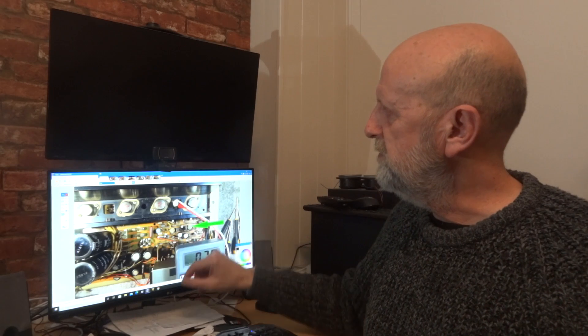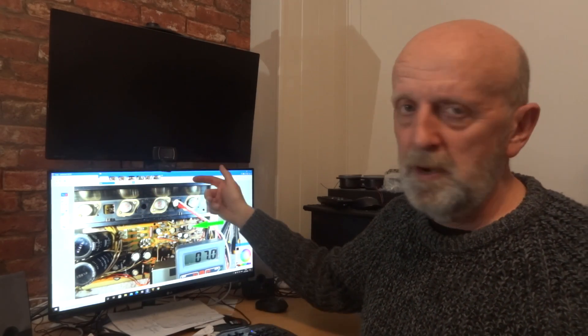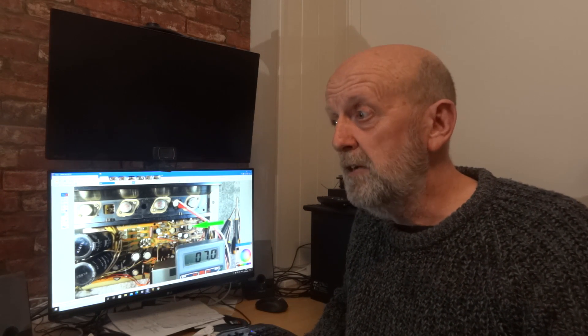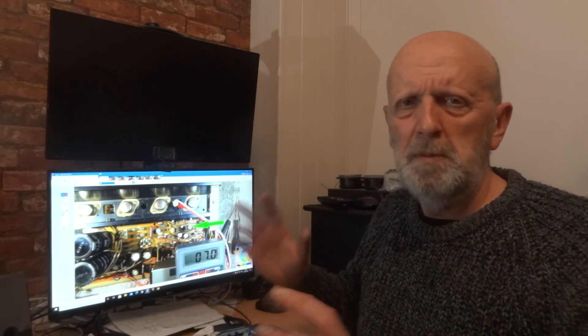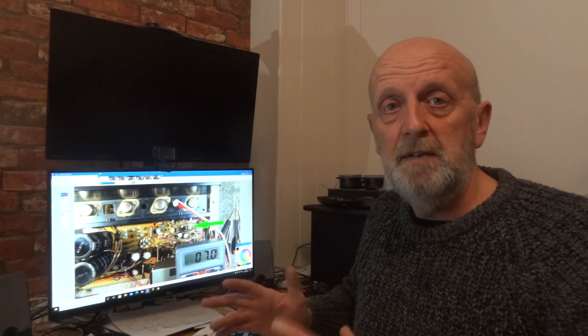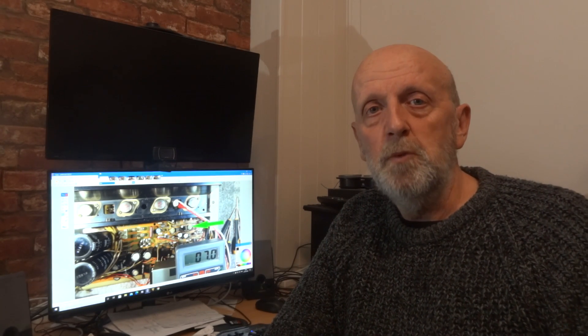You may not have dedicated test points and may have to measure directly across the resistors — on this amplifier the resistors are just behind the heat sink, one per channel. Check your service manual for your specific unit. Once both channels are set, put it all back together and the job is done. I'll be doing more videos on this amplifier — changing two capacitors and also looking at some dry joint soldering from when I first got it. Be careful, caution caution caution, and maybe have someone in the room. Thanks very much for watching, see you soon.